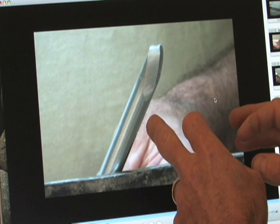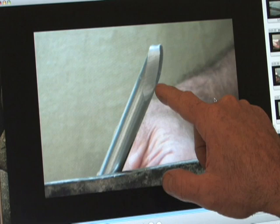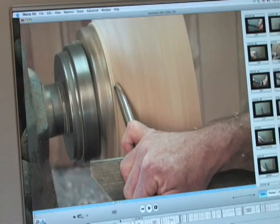Okay, let's get onto our half inch bowl gouge here that I call the shear shaper. It's a shear scraping tool. And notice the very long cutting edge here. The longer and steeper this angle is, the steeper I can get it to the surface of the wood, which will give me a cleaner surface as I cut. This tool takes very light cuts, and I put a lot of pressure on the tool rest as I work with it. Let's take a look at this tool in action.